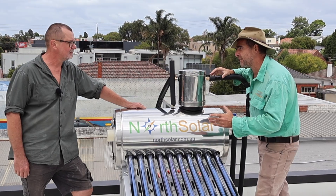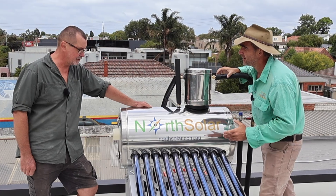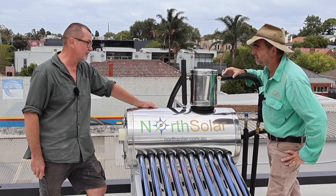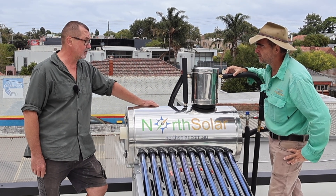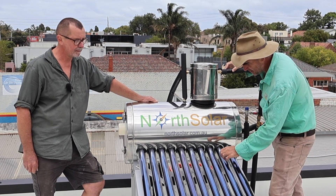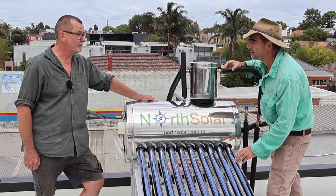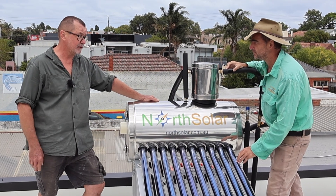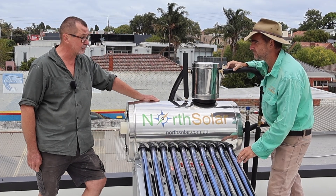Andrew, you're the guy behind these systems. They seem too good to be true — 94% efficiency. The evacuated solar hot water systems have a range between 91% and 94% efficiency, and they are so efficient that in summer they will actually boil. They're an incredible system. And these tubes — they're glass. Are they strong enough to withstand things like hail? They are rated for 25mm hail, so effectively you can throw golf balls at it. Cricket balls might be a little more challenging, but generally it is very difficult to break the tubes.